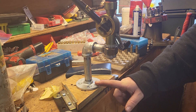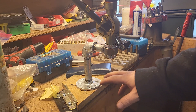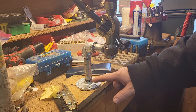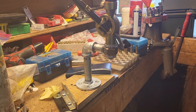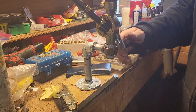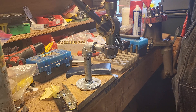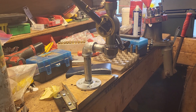This is half-inch pipe — I was going to do it with 3/8 but they didn't have a 3/8 plate. If you buy one of these plates, check it because mine was warped and I didn't notice first. I put red Loctite on the threads so they're not going anywhere — it'll break the pipe before it breaks that Loctite. The $20 stand took maybe 10 minutes to make, and five of those were dragging the welder across the shop. I'm not paying $70 for something I can make in five minutes for five bucks.